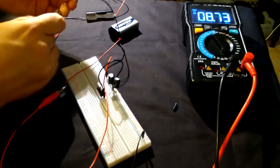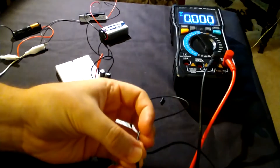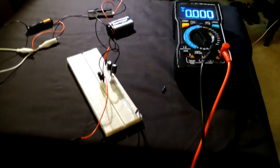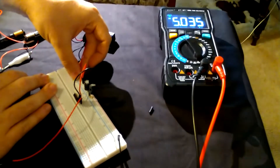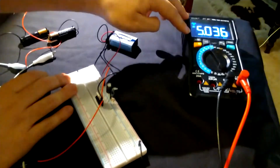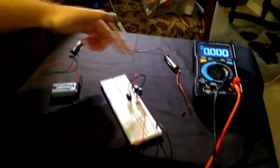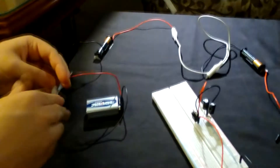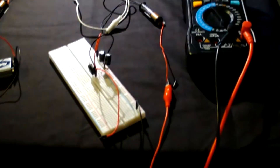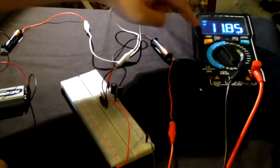Let's see what happens if I connect it. The red cable is going back to measure the output voltage, and the multimeter is set to measure from the ground to the output. Now that I connect the 8.7 volt source to the circuit, I got 5.36 volts — almost 5. The reason is that this is an LM7805, which regulates to 5 volts. Let's use a higher voltage by connecting these batteries in series. Measuring the combined potential difference, we get 11.85 volts.